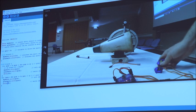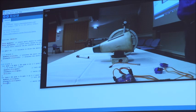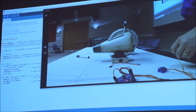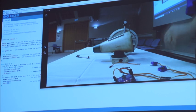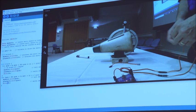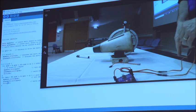You mentioned earlier that you can just apply a full sway signal to the servo from 0 to 1024. Is all the library doing here is converting that number into an angle? So if I didn't have to use the library, I was quite happy to put 0 to 1024 rather than 0 to 180. Yeah, pretty much. You can control servos direct without using the library. You just write them to a PWM position, and it will pretty much do that. The servo library just makes it a little bit easier for you, really. If that makes sense. Cool. All that makes sense? Good.